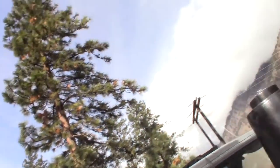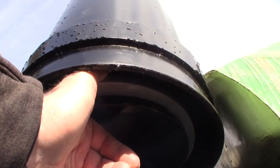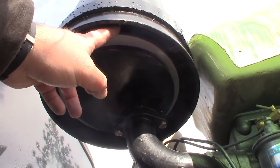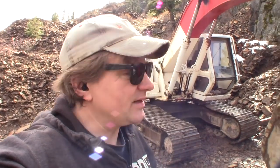So, for instance, Elderly Iron recommended the brace, so the vibration would probably be a problem. I'm sure you're right there. And then my father was concerned that the air cleaner could slip off its base sideways without being noticed under the bucket and then suck. So I have welded all the way around the ring a metal band that captures the rubber gasket so that it can't walk off sideways. I'm not used to the wide angle lens on this camera.